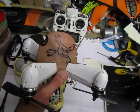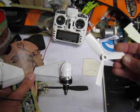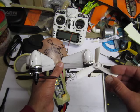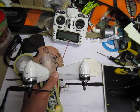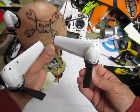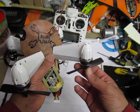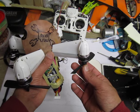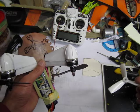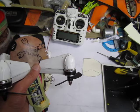I tested the motors — I burned one. These are 4-inch 3-bladed props at 4.5 pitch. The first little smoke came out with these props, and then when I put the HQ 5.4 props, one motor smoked completely, pulling something like 30 amps. These are the 4-inch bullnose props — they pull out roughly close to 30 amps. The static thrust is roughly 1.2 kilos. When running them in the air there's 20-30% less amps. When I finish with these ones I will stick these on in the air and we'll see how it goes.